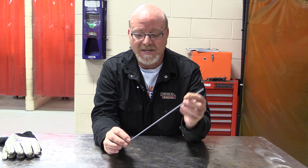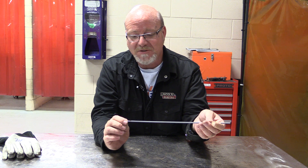We simply cannot use that whipping technique with a 7018 because of the difference in flux — the 7018 has a big heavy flux, while the 6010 has a light flaky flux. So 6010 has its own special characteristics and its own special techniques. Get in the booth, grab a big pile of it, and burn them up. By the time you go through a plate or two with 50% overlap on those weld beads, once you get to your other welds, you will already have this stuff mastered.